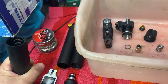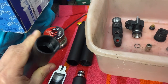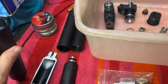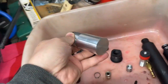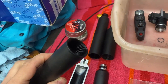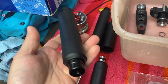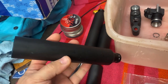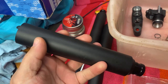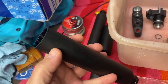And next time when I have my common rail injector set up on the lathe, I'm going to put a diesel injector nipple into the end cap that I made, this one. I'm going to thread a diesel nipple to this, and I have 2,400 bars from the diesel pump, and we have the yielded cylinder. It would be interesting to see where it fails, if it fails from the thinnest part here or the O-ring.